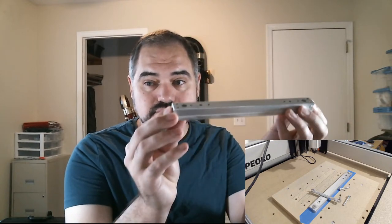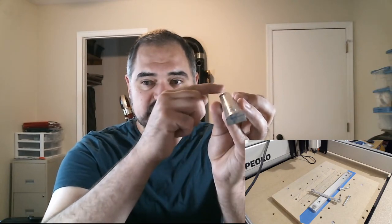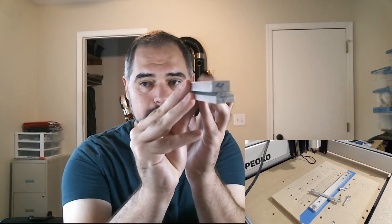I'm going to have a whole video on that. But I figured let's take it one step further and actually make a shaper. So I'm going to be making these out of aluminum, and I'm going to be starting with this. This is two pieces of aluminum, and you can already see I've gone in with the Shapeoko and machined this arc and a matching arc on the other side. This way, the cane is held in between the two arcs.